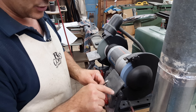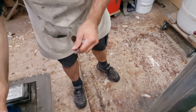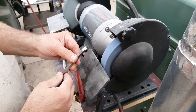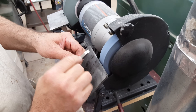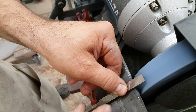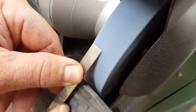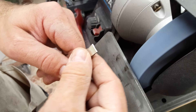That's 17. Now, whether or not your grinder's tool rest is actually parallel to the front of the stone — it's not always that precise. Even though I've been holding it square to the front edge of the tool rest, I'm actually a little higher on the right side than on the left. So instead of holding it perpendicular to the end of the tool rest, I'm going to turn it at a little bit of an angle to correct that.